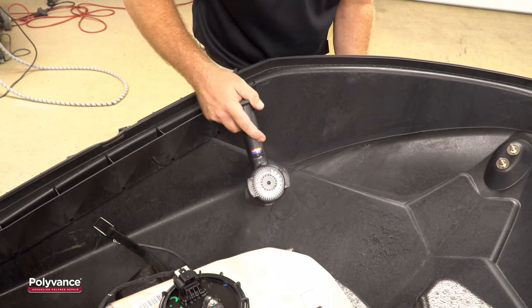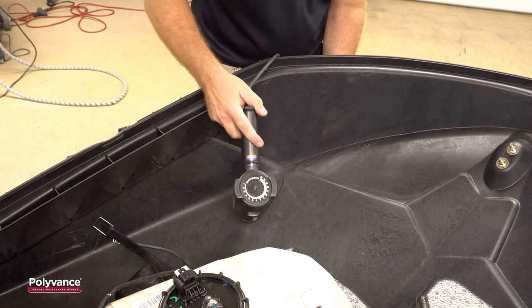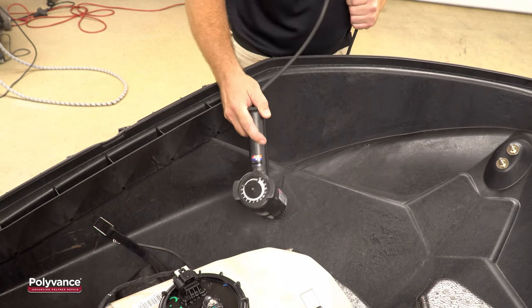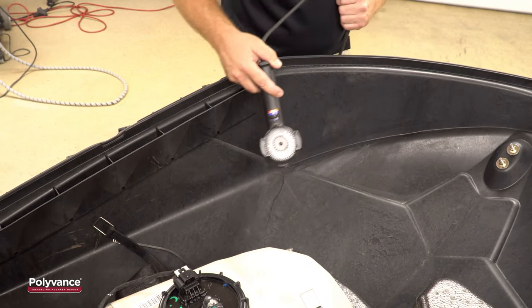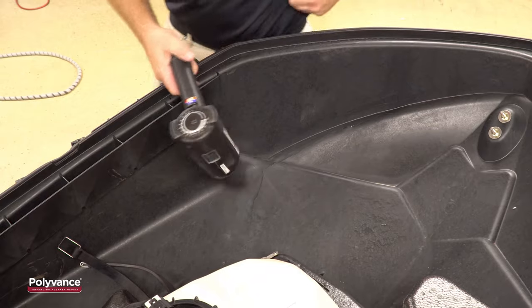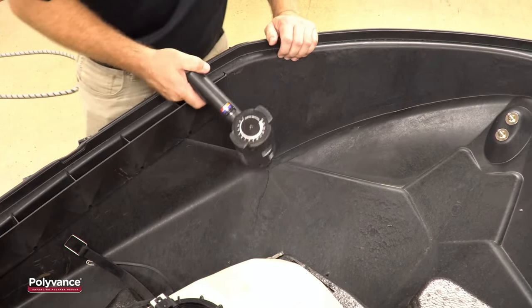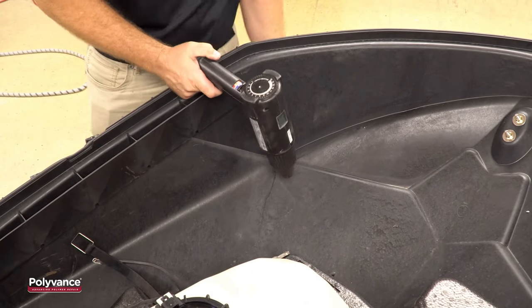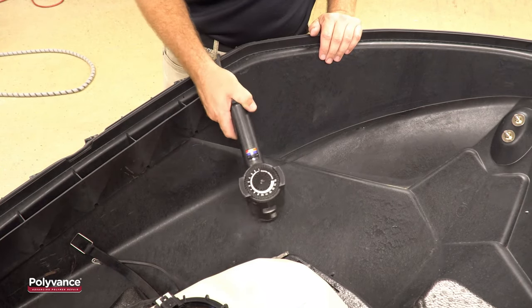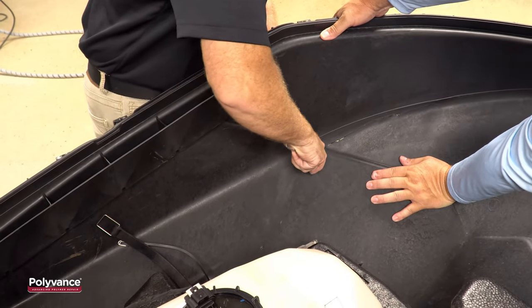Because the impact distorted and misaligned the surface, we first have to heat the plastic up and push it back into proper alignment. Using a heat gun and some patience, heat the impact area and the surrounding area about six inches out from the impact to soften the plastic. It is best to heat from one side until the plastic is too hot to touch on the opposite side — that way you know the plastic is heated all the way through. In this case, the crack wasn't straight through the hull; it was sheared slightly at an angle and the parts were not overlapping properly. Heating it will allow you to soften the plastic enough to push the sheared areas back into position.